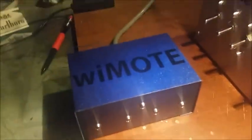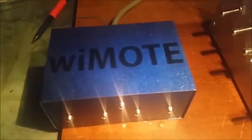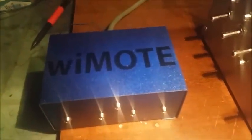And I'm going to tell you something else too. An LED can emit and be forward biased without a dang ground. If you don't believe me, check it out. That's what that one was doing. I had to actually switch some things around and put the current limiting resistor on the other side other than the ground. It usually doesn't matter, but in this case it did. But anyway, we got it all straightened out, man.